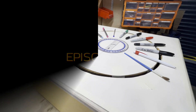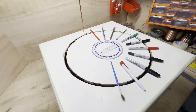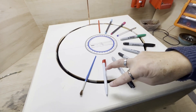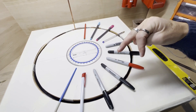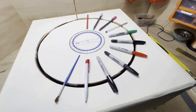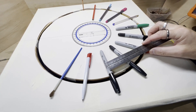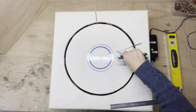Welcome to episode 5. So what I'm trying to do is picture the radial distance that I want coming out of the center for the supports that are going to go up and support the curved track. These are almost every 20 degrees, which means on the inside rail the distance between the two will be something like 60 millimeters and on the outside something more like 80 or 90.